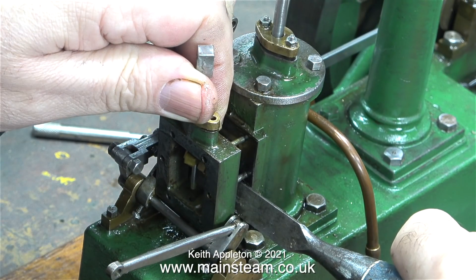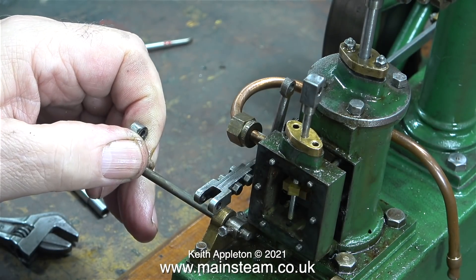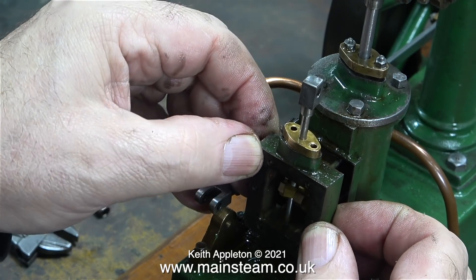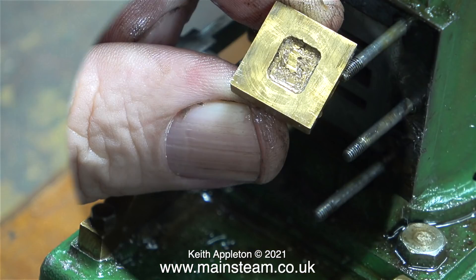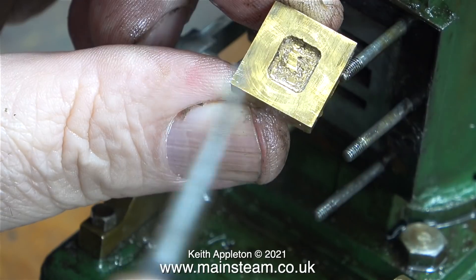This is something that's worth remembering: you can't remove the steam chest on one of this type of Stuart beam engines with the cross shaft in position. You can remove it if you undo the left hand gun metal bearing, which allows the cross shaft to be slid out of the right hand side bearing, but I need the entire mechanism removing because it needs some work. Here's a close-up shot with the mechanism out of the way — the port face is in quite good condition, which is more than can be said for the valve. This middle part is supposed to be milled out to a certain depth, and like this it's a bit uneven and a bit shallow. I'll probably do something about that.